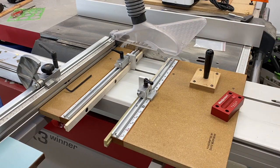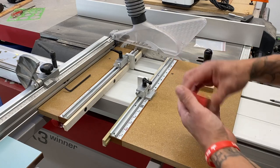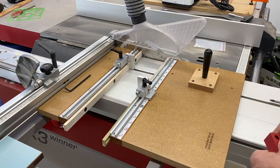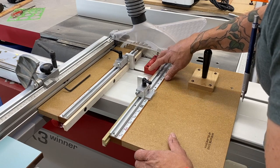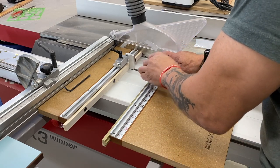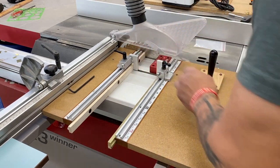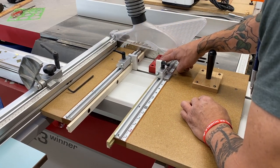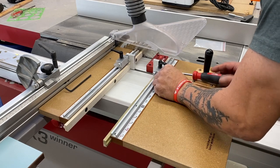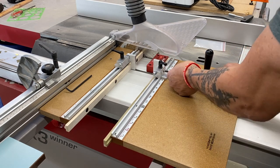To calibrate it, Dave's instructions are really simple and effective. You take a 1-2-4 block — this one is calibrated to be exactly four inches, which I checked with a mic — and you put it right up to the blade, ever so gently bringing it up. These stops are beautiful, there is zero play. I've already calibrated the front one, so with that four-inch block against it I move the stop right up and make an adjustment on the cursor to read four inches precisely. How simple and beautiful is that design.